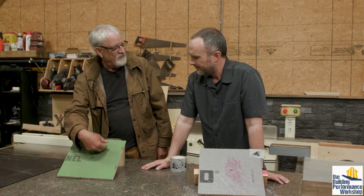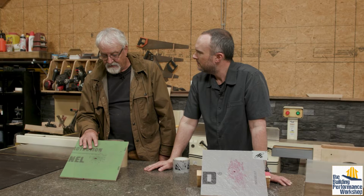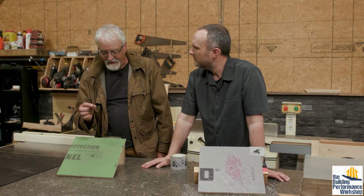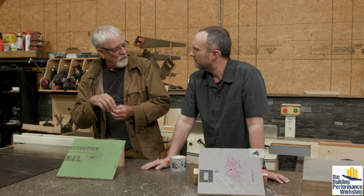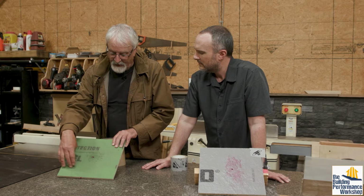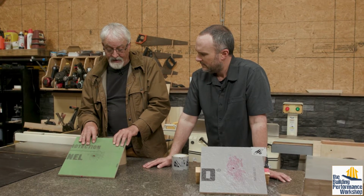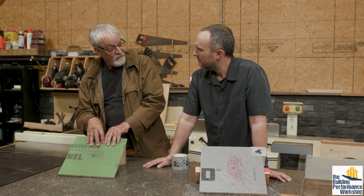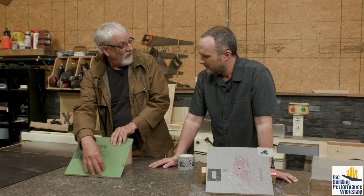Okay, and then you've got a bunch of nails from the shingles going on there. They're not really sealing around. Your best seal around that nail is the shingle itself. As it goes through the shingle is where you're getting that water sealing. So you've broken the plane of this, but in its service, it's going to be fine. Now, if you replace that roof, you're going to have to cover this up because of all the holes.